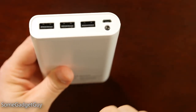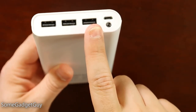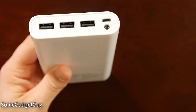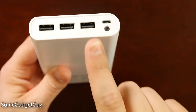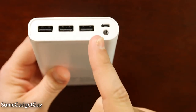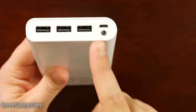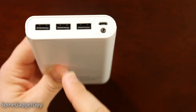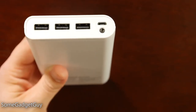This thing is so large we have a trio of USB ports on tap. You can charge three devices at one time, but these things are staged. We have a 1 amp output for USB port one, a 1.5 amp output for USB port two, and a 2.1 amp output for USB port three. At 2.1 amps out, this USB port three might not do a great job charging devices like iPads, which are usually built around a 2.4 amp output for their charger. So charging might be slow on some of those devices, but this is going to be the only port that might play ball with fast charging capabilities on our phones.